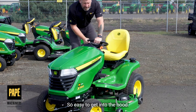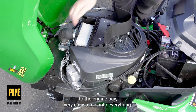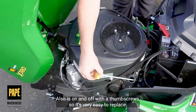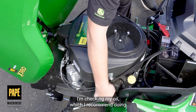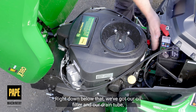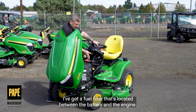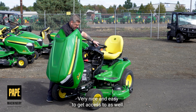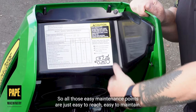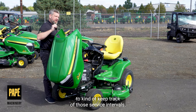Let's talk about maintenance on this particular one. Easy to get into the hood, and when I pull that hood up, I've got great exposure to the engine bay — very easy to get into everything. I've got my air cleaner, which is easy to get into and comes off with a thumb screw, so it's very easy to replace. I recommend checking your oil before every time you use the machine, right there — and this is also the fill tube. Right down below that we've got our oil filter and our drain tube, which is easy to access and very convenient to use. I've got a fuel filter located between the battery and the engine, very easy to access. My battery is housed right back behind the engine. All those easy maintenance points are just easy to reach and maintain. And I've got a placard on the top of the hood to keep track of service intervals.